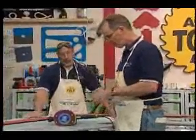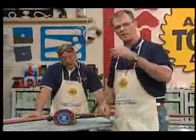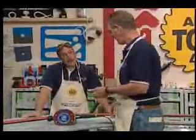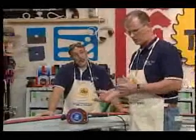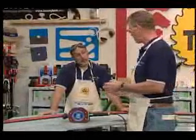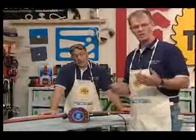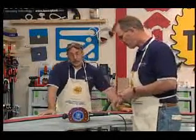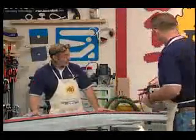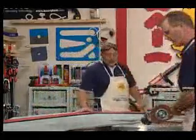The benefit for doing that is by cutting up from the bottom, we're not going to have any blowout or chipping on the bottom, right? Nor will we have it on the top. And we don't want to run the risk, since we're doing a cutback that's so close to our finished size, of having to create any chipping that is going to reduce our final dimension. So we have that. And John's got the straight edge pretty well set up.